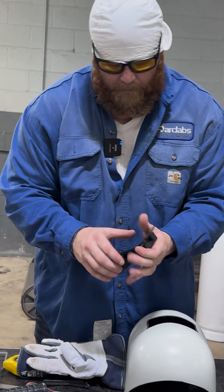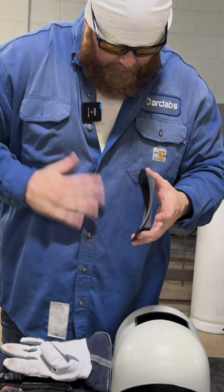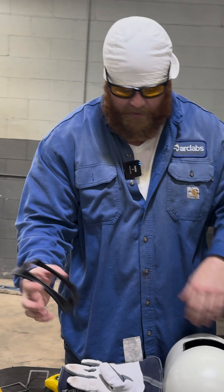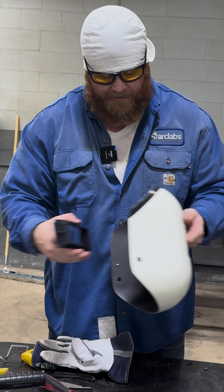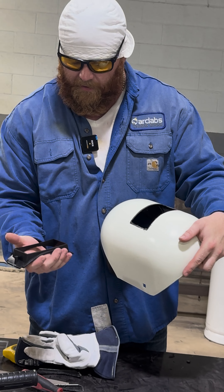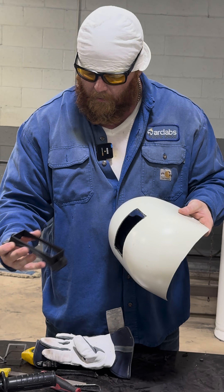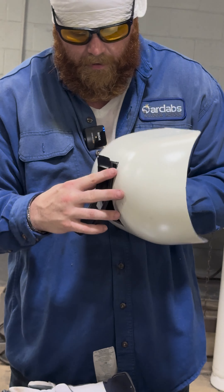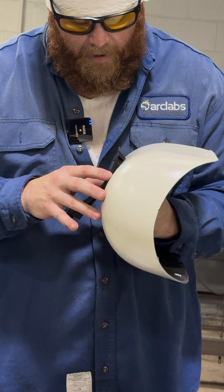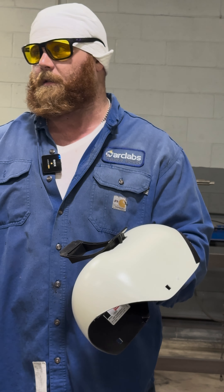This piece here is three piece. This one holds the back lens in, the clear lens. You have this piece which is basically like a gasket — so you lay it out, this goes in here, then that goes on top and it seals everything, keeping the arc from getting to your eyes. How I do it, I take it, turn it upside down, slide it all the way to the top. I'm going to lay out the locations of this hole, which is where a lot of people can go wrong — if you overcut it, it won't fit and you've got to start all over.